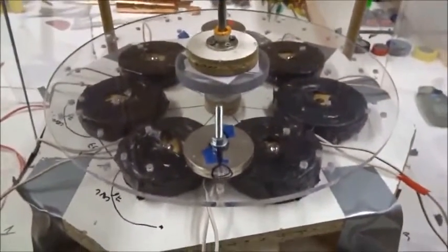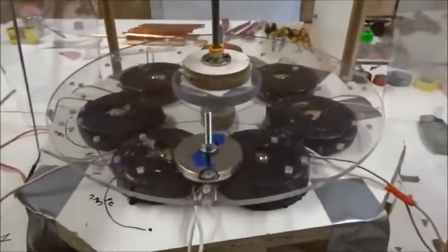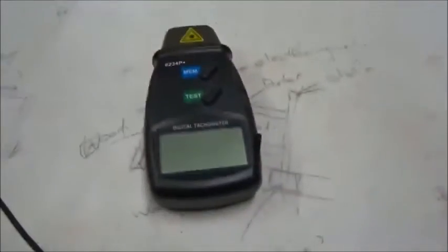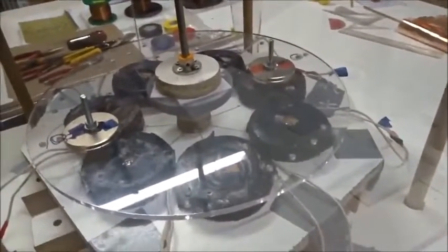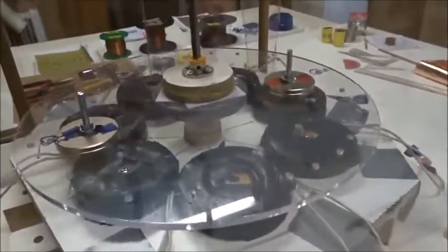That's the principle of this new device. I've got a drive motor to make the rotor spin and a little 12-volt power supply. We're going to turn it on, make it spin with the drive motor, and monitor properties like voltage and current using a multimeter. We've also got a tachometer to measure RPM, and we're going to see the actual physical properties at higher RPM. At low RPM it makes electricity very well without hardly any slowing of the rotor, so this is our first high-speed test.